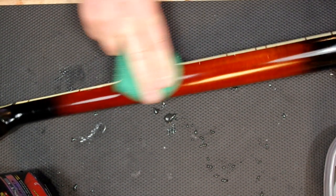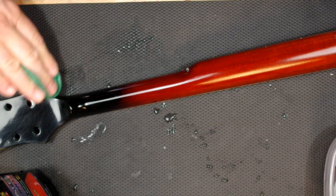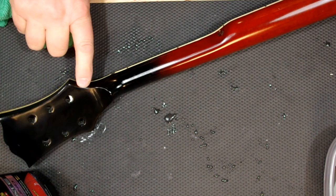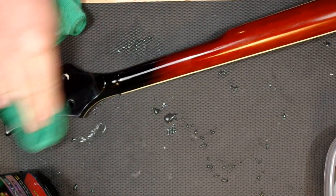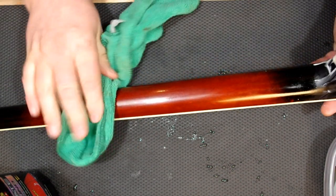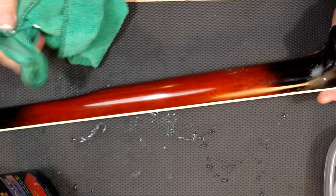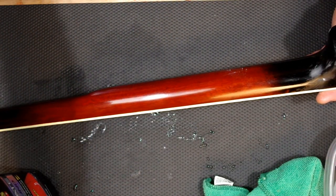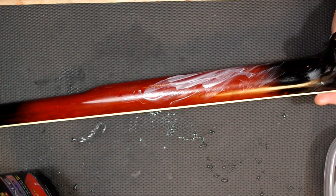I mean, if you're using a machine that's spinning and you come up on an edge with that disc and it rolls up onto this edge, the edge is going to get worn away, or it's going to develop so much heat in friction that it will actually burn the paint or the lacquer, whatever it is you've got on it. It'll burn it, and then it's unrecoverable. You'd have to apply new finish to it because it's burnt, and that's something you don't ever want to do.